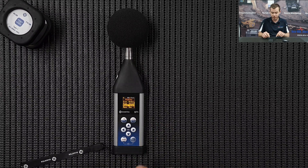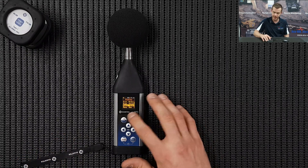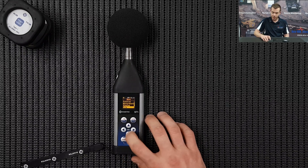Basically we're going to see the maximum result in those octave bands on the instrument itself. The data at the end will still have all of the instantaneous LEQ in the octave bands and the instantaneous results in the octave bands, but just on the measurement display we want to see the max value. After that press Escape.